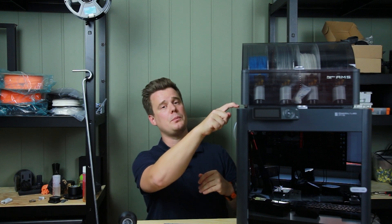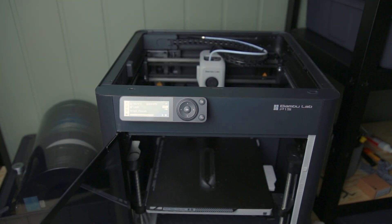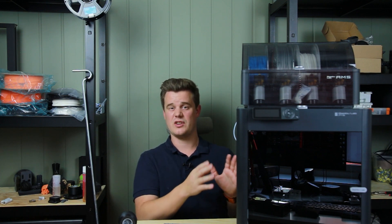The important thing is that PLA still prints perfectly with this machine — there are enough fans to really draw out the air and keep it cool inside. But if you live in a really hot room, you might want to take out the top glass; it's as simple as lifting it up and opening the door, and your printer is like a P1P again. I was a bit concerned about adding two more fans, but for me the sound level has actually become lower because all the high-pitch sounds are gone. There's still quite a lot of noise, but the enclosure does keep some of the sound inside.